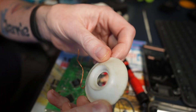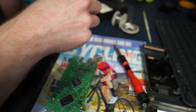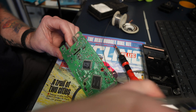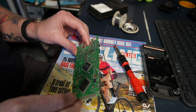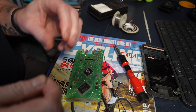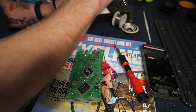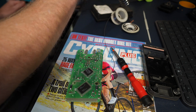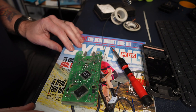I even found some old solder wick - that's an old thing, look at that. Anyway I don't need that I don't think. It's too thin to do any repair and it's so close to this area which goes straight through here. I'm just going to bridge it with a piece of Kynar wire that I've dug up. I've trimmed it to about the right size, tinned both ends, and we'll try it and see if it works. Is this iron hot enough? It'd help if I switch it on - hopefully I'll have a bit of heat now.